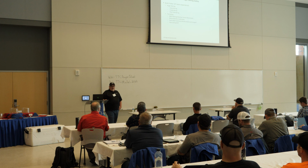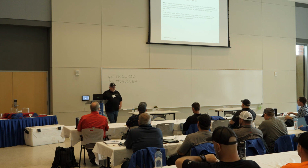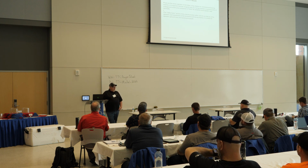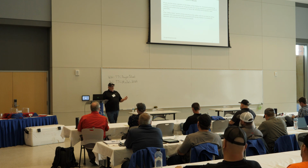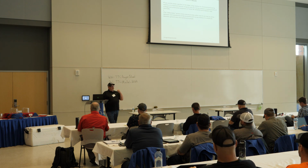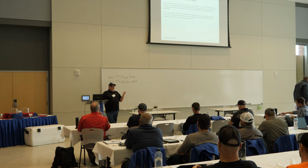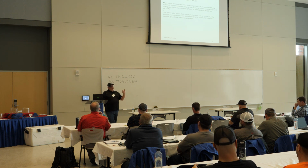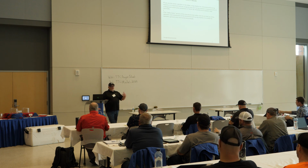So you've got a lot of these safety rules, and with these machines, I stress to everybody, make sure whoever's machine you're using, make sure you read the owner's manuals and know the capabilities of those machines. It's good to know that because you might get a certain machine and think, okay, I've got plenty of power to do this, but I gauge my jobs on 60% of the power. Make sure you're using that much or less. If you're going to more than that, step up your machine. Especially if you're doing rentals, you can get all the machines available to you to do that.